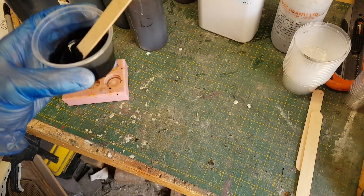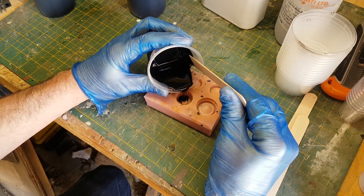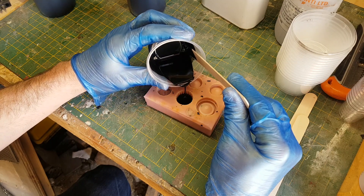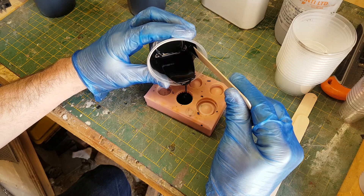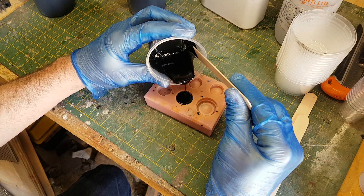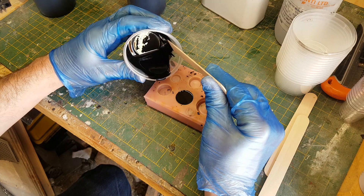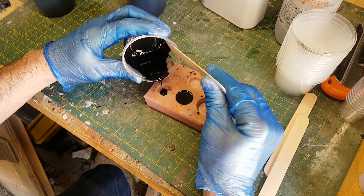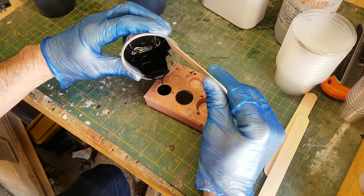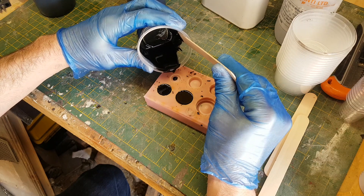Get the scales out of the way and pour slowly into the mold — doing it slowly so air doesn't get trapped. I've generally found it's not much of a problem but occasionally if you just dump it in there it can trap air. The good thing about these small mechanical parts is that because they're so small it doesn't take much resin to get a cast of each. So if you're trying to create mechanical detailing on a robot or a spaceship, you end up with lots of tiny little bits which are really really useful.